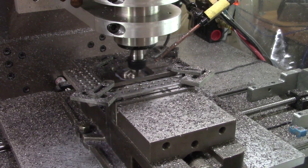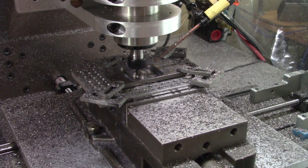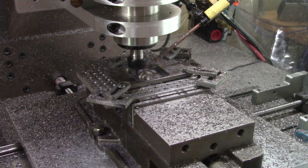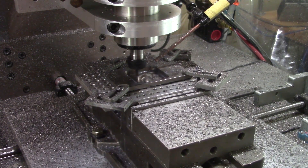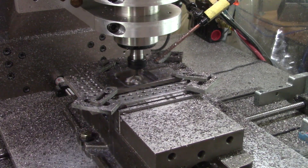The horrible high-pitched noises are from the lack of work holding at the front of the part. You can see along the front bottom edge where I was testing on the other side of the metal. The last depth of cut went through that area, so the entire front of the part is now unsupported.